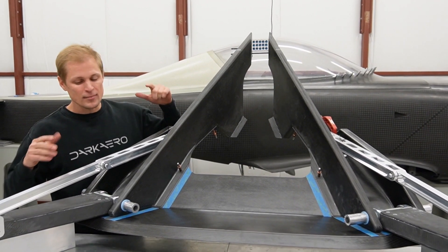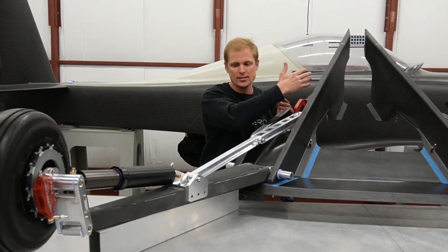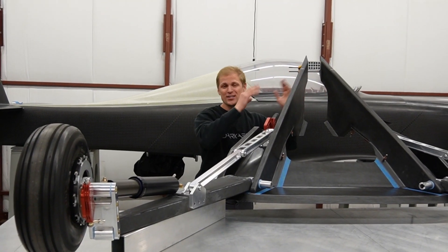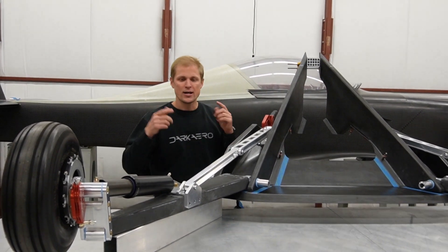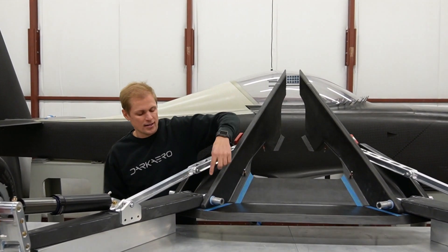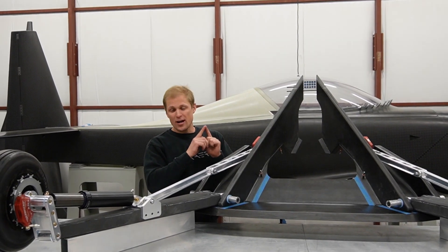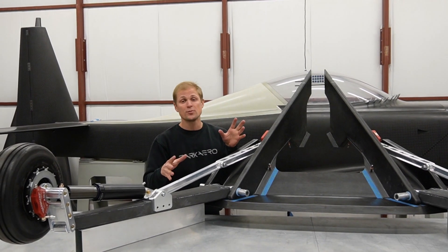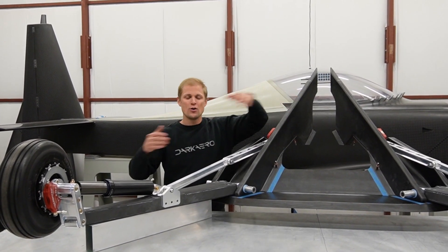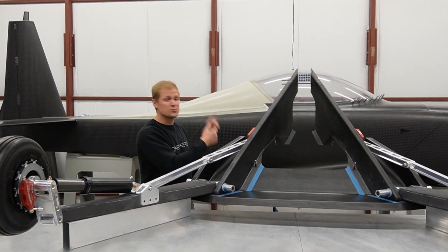Back to the whole assembly: the gear has to retract back up into the trunnion frame, which forms part of the wheel well for the struts. When they fold back, the gear has to collapse and fit up into the fuselage, which tapers in this area — so they're fitting into a constricting space. The retract mechanism is accomplished through electric drives — a gearbox and electric motor on each strut that interfaces with the strut through a large spur gear. That's not installed yet, but we'll cover it in a future video. There's also an emergency extend mechanism driven by a gas spring, very similar to what we did on the nose gear. Currently this is assembled with just temporary fasteners so we can see it as a full assembly.